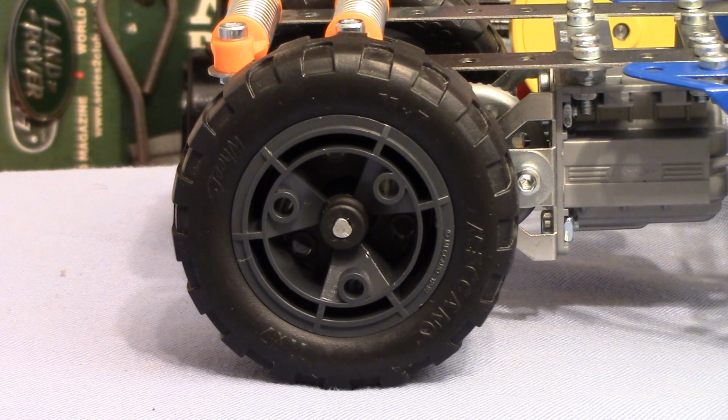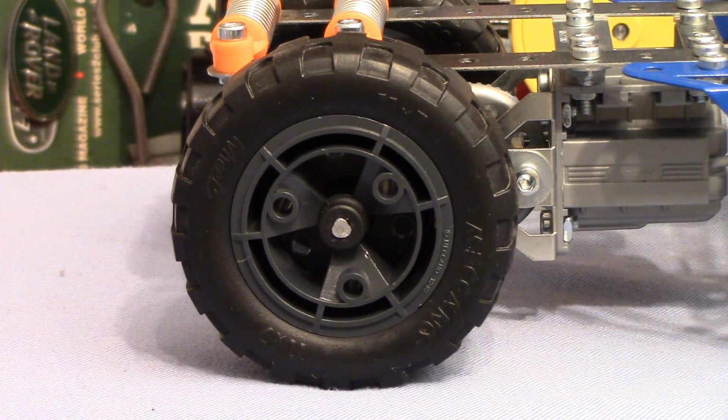The problem with it is the axle's too short. Now, the axle in the parts list at this stage listed the 130mm axle. The diagram that you measure, which is included at every stage now where there's something to measure like a bolt or an axle, which saves you turning back to the front or the back of the book every time, was 130mm as well. The length of the axle is actually 126mm, and there you have your problem. It's only a few millimetres, but it's enough.